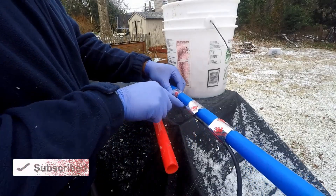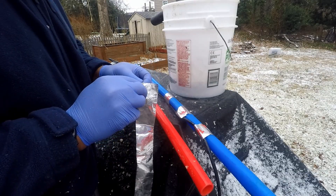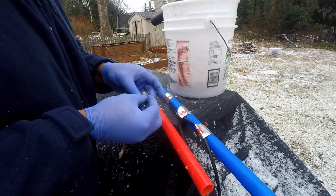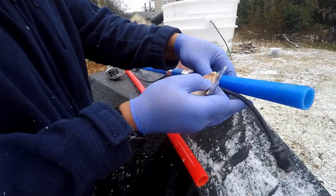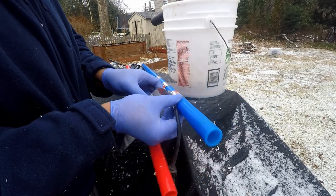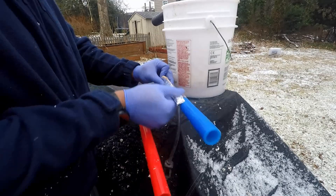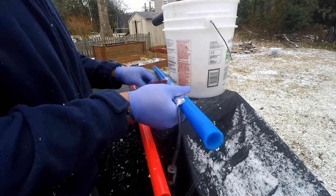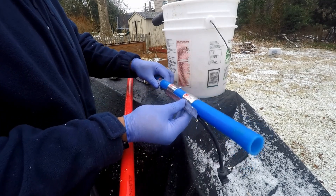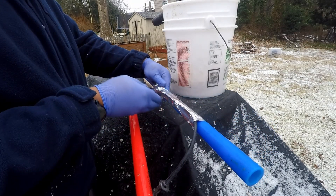It's easier to do in practice than in this simulated environment, because there's nothing holding the pipe firm — so when you pull on the pipe, the whole thing goes. There's more fine motor work here. Now the heating cable is attached to the pipe. This particular application of foil tape — and it's very important that it's paper-backed — is to spread or increase the thermal effect, basically dispensing the heat out along a larger portion of the pipe. Considering dust, the paper-backed foil tape is the way to go for a better, smoother installation.